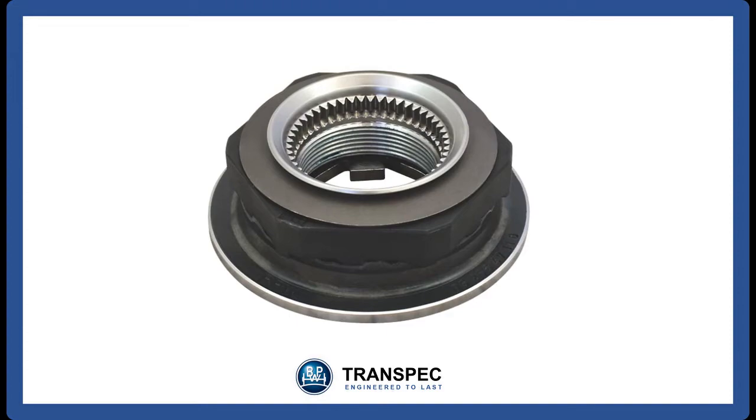Do not wash the self-torquing axle nut, as this can lead to damage by washing away the internal grease. This then means that the self-torquing axle nut may operate at a different torque setting, potentially damaging the hub bearings. Immediately replace any self-torquing nut that has been washed. Simply wipe clean after testing with a clean rag and reuse.